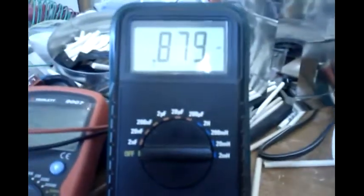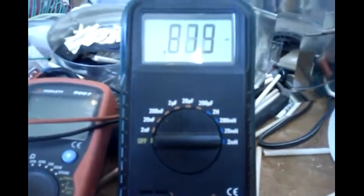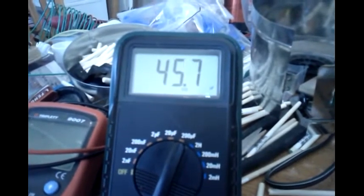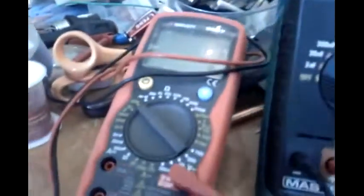Focus is not too good on that. I've been playing with this coil for a while — squashing it together, which increases its inductance. It's up to 880 microhenry, and this meter says it has 45 microfarads. This other meter has a capacitance reading but it doesn't measure a capacitor like this one does, apparently, because this just reads zero.